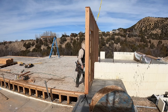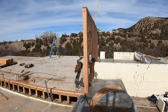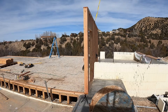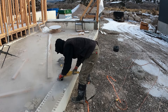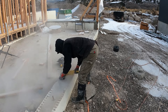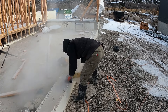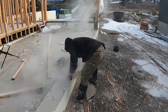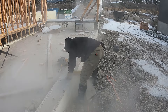I've got a plate on the floor because I have an inch and a half of concrete going on there for my radiant floor, so I've got to lift the walls up an inch and a half and shoot onto the plate I've already nailed down. Getting ready to frame the garage — I lost that footage. You take your grinder and flatten everything out; so many imperfections will screw it up and show up in your fascia, wrinkling your aluminum. That's the end of this part. The next video is going to be the structural steel, which I have to put in to continue framing.